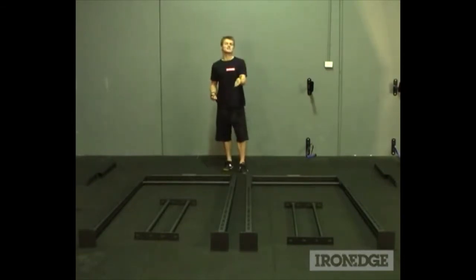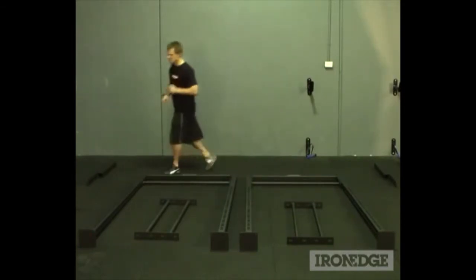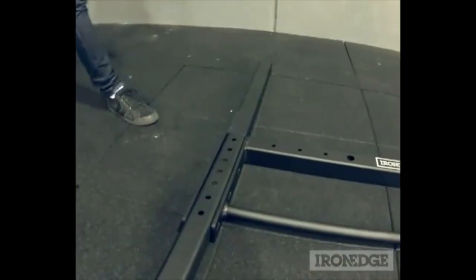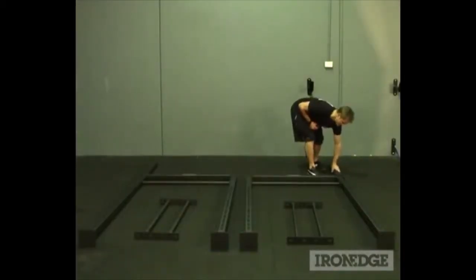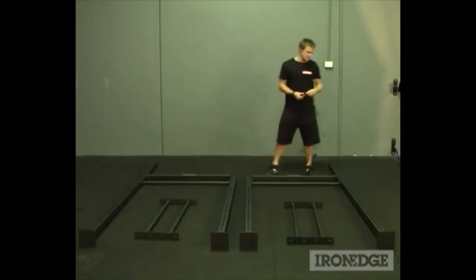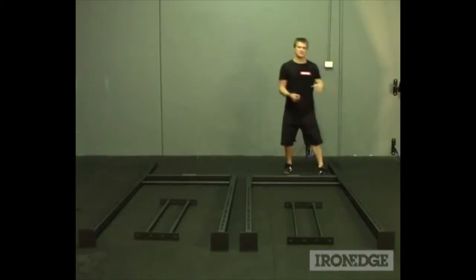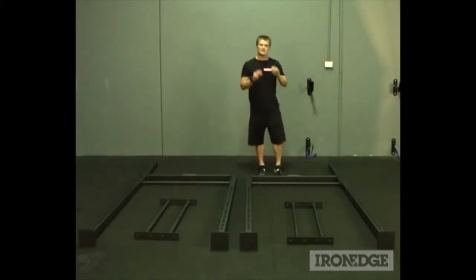Now what we're going to do today is run through a matrix cell that's going to extend out and utilise bridges. So we want to use our extension pieces, and we just want to line them up on the outside, on either outside of the uprights, just like so. Now this is where you want to use your 110mm bolts, because the 90s won't be long enough to go through. Naturally at this stage there's a bit of a trick that we need to run through with you as well, so just do them up finger tight at this stage.